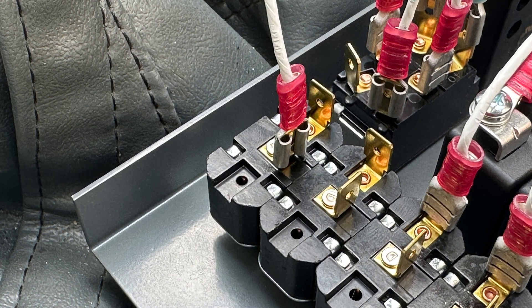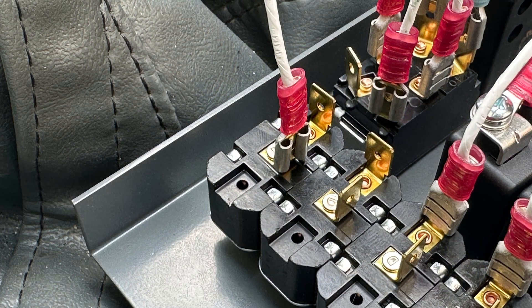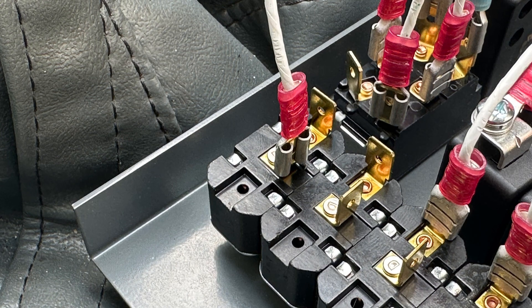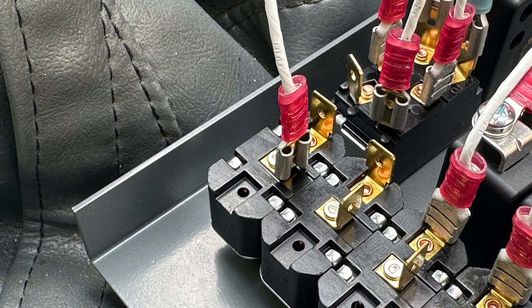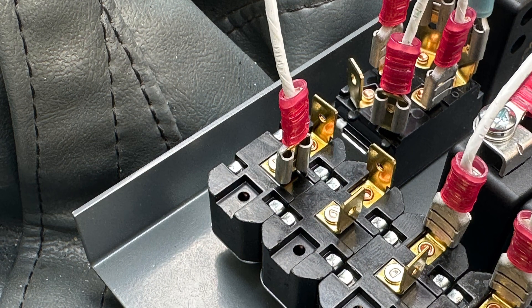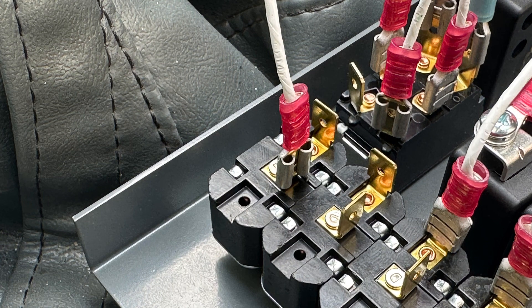Here's a picture of a little sub-panel that we made. It just kind of piggybacks onto a section of the console of the Zenith airplane. It was part of the console that was available for switches and breakers and all the stuff that we show on our website. We utilized that section, cut a hole in the existing console, made this part on the bench, and it is now set up so that it can be installed with the same two screws on each side and also removed if needed without having to take the whole console out.